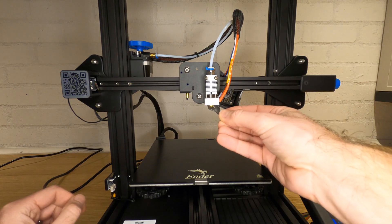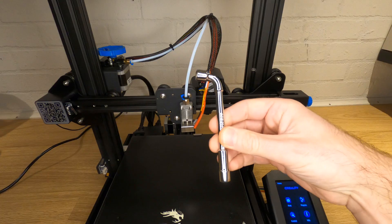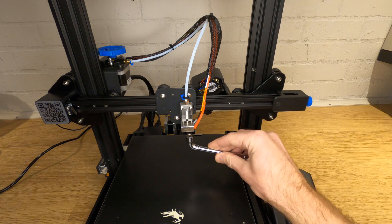It was at this point that I found the spanner supplied with my printer didn't actually fit the nozzle. The best tool to use here is actually a socket wrench rather than an open-ended spanner. This way you never actually have to touch the hot nozzle and you won't round off the nozzle. I've put a link to these wrenches down in the description, but just check the size of your nozzle before you buy as they can come in different sizes.